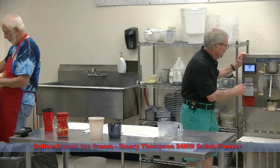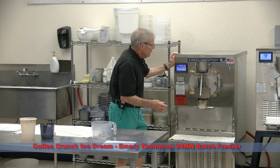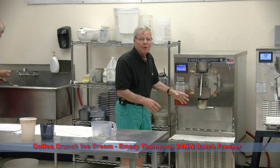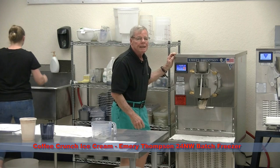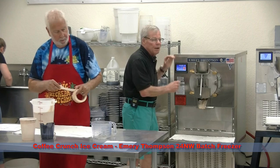I go to make ice cream. We're running super premium. Sure, that's close. So here I am at my super premium speed, 165, and I want to fill pints. So I'm just going to tap it down to 130. Now it's spinning slower, and it'll come out a little easier. You still have to be fast. You want to open it, close it, put it up here. Open it, close it, put it up here. And then when you're finished, come back to it and put the caps on them.